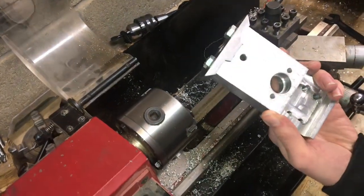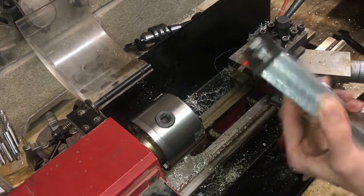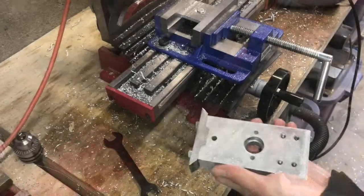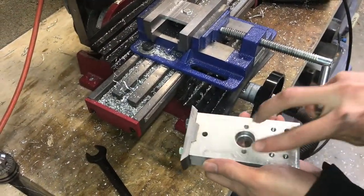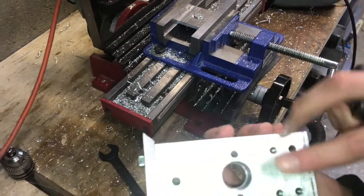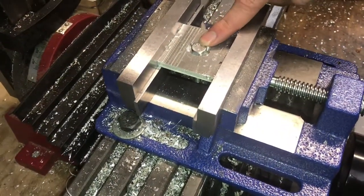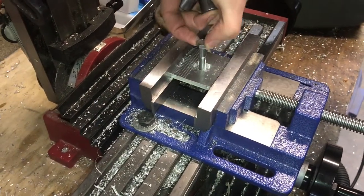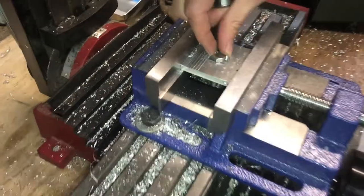In order to do that, I need to make sure that it remains perfectly true, and this is a somewhat awkward thing to mount. My plan is to build a plate that will fasten to these two holes, and in the center I will drop in a 5/16ths bolt. It's in the slot, and it locks so that it's fixed rotationally.